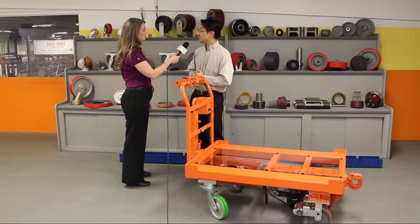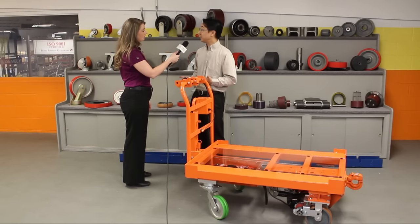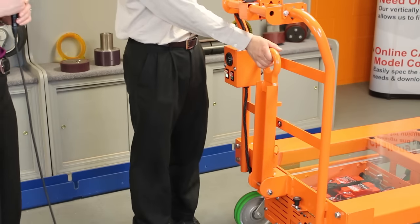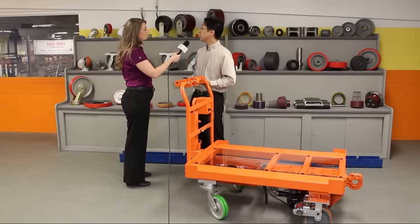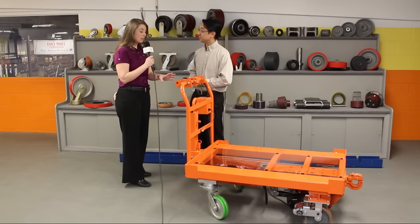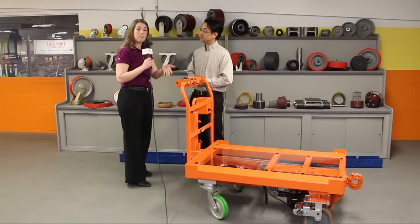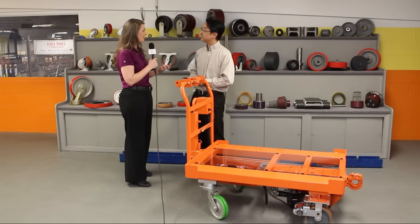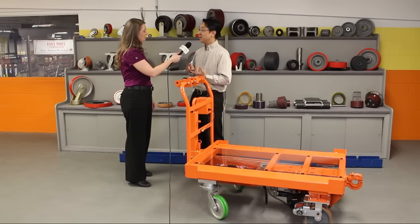The last really unique feature is the auto disengage when you're actually towing. The drive caster actually acts as a brake when you don't power it up, so when you're trying to tow it, you actually have to lift it. When you activate the tongue, a sensor senses that and will automatically lift the drive caster and allow you to tow it around the plant. So we have some built-in safety features, but also features that make this versatile — it can be manually pushed as well as hooked up to a tugger. It has a dual functionality so that you can do both drive and towing.